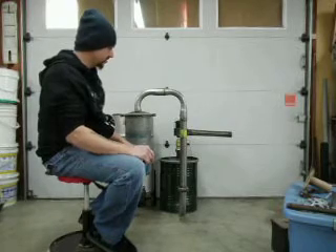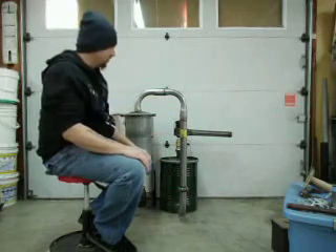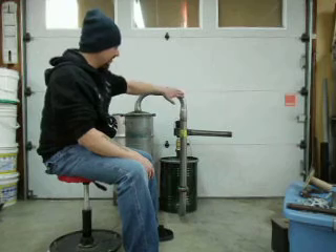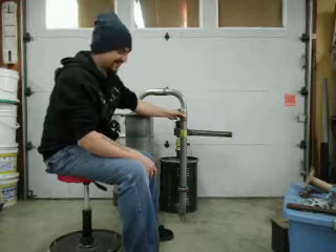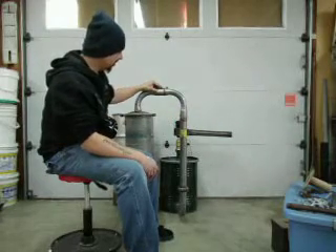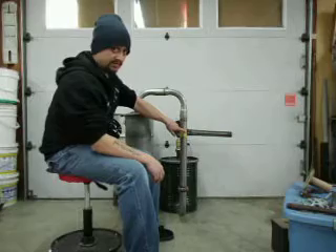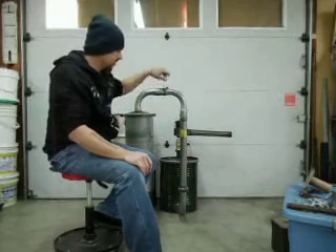In this particular system, I bought five-foot two-inch straight pipe and three 90-degree bends, which saves time since they're pre-bent. Now, one of the mistakes I made in my earlier videos was calling these 90s 'flanged' — they are not flanged, they are belled. What they do is expand one end of the pipe so the two-inch will slip over another two-inch pipe, which makes it really handy for welding. You just slip the two together and weld it out.